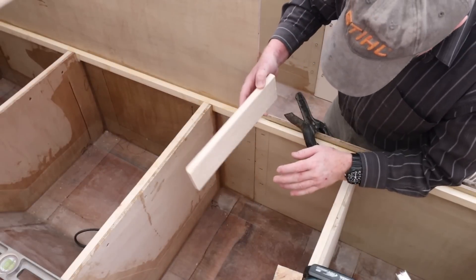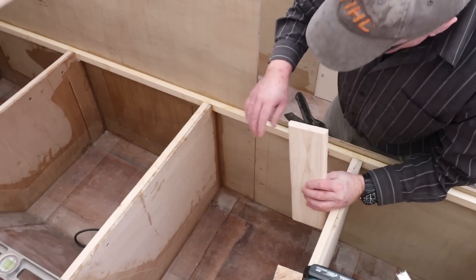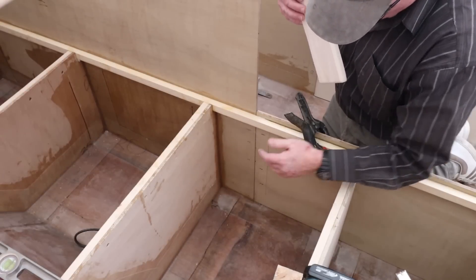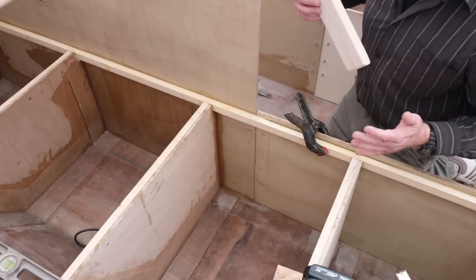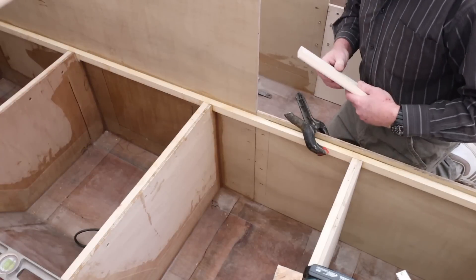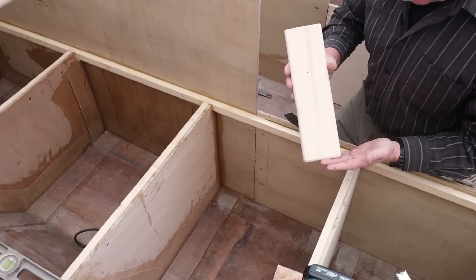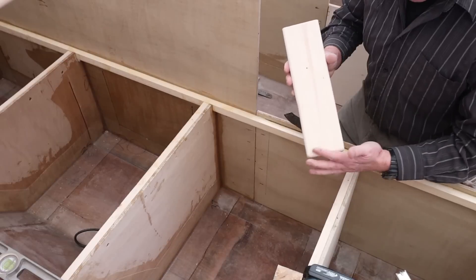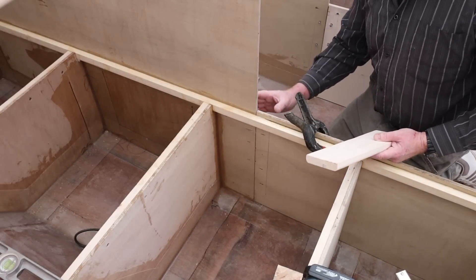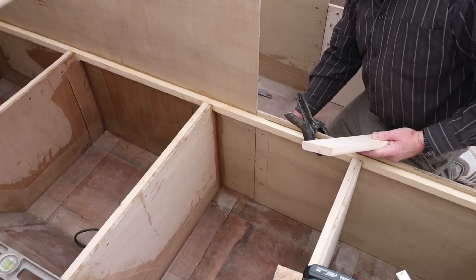The next thing we want to do is put a couple of butt blocks on here, and that'll just bring the plywood together and make it all continuous. It is a longitudinal, and the more continuous it is, the more powerful it's going to be. Just a little bit of glue on this — it's a regular piece of construction one-by-four, I've just rounded the edges. It'll get sealed in epoxy and the front will get fiberglass over top of it.